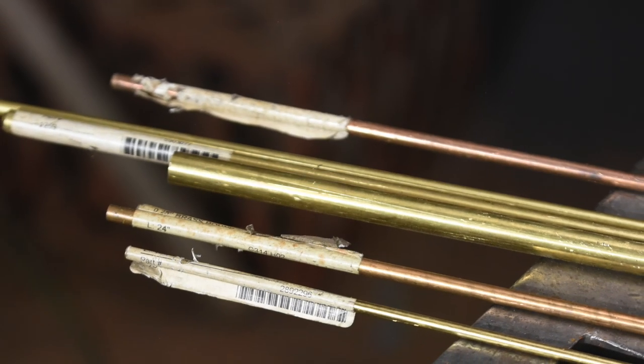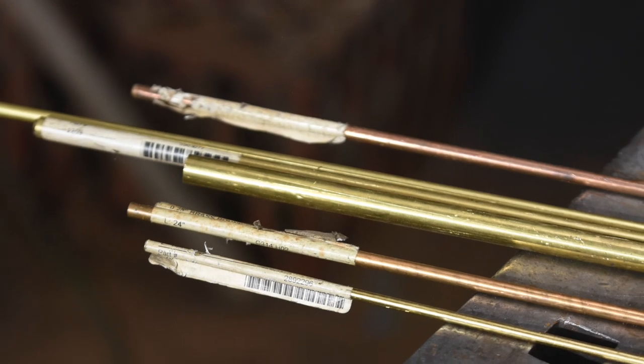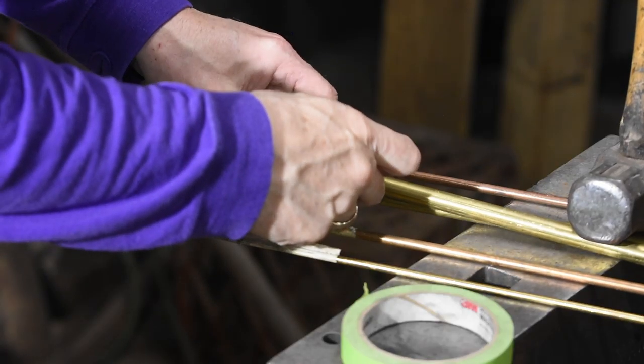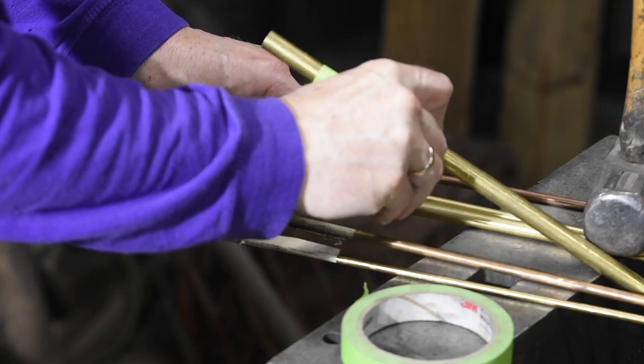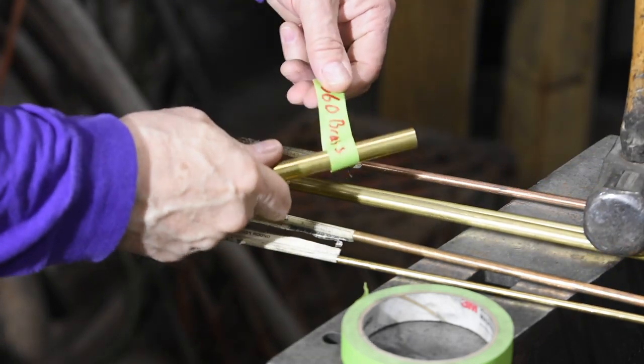This is also great for any kind of metal stock. All brass is not the same; all aluminum is not the same. It's pretty easy to buy a piece of 360 brass and then five years later it's sitting there and you have to guess based on color or licking it or something. Is it 360 brass? Is it nautical brass, muntz metal, phosphor bronze? Save yourself the guesswork and the dirty tongue — put a label on it.